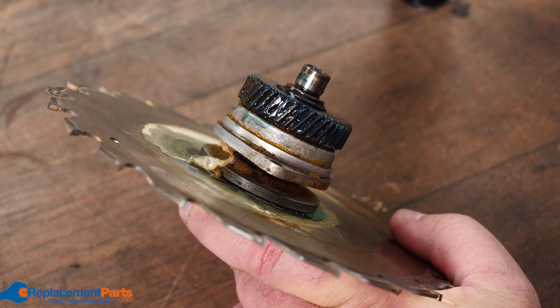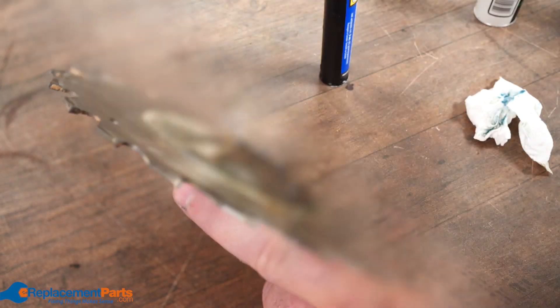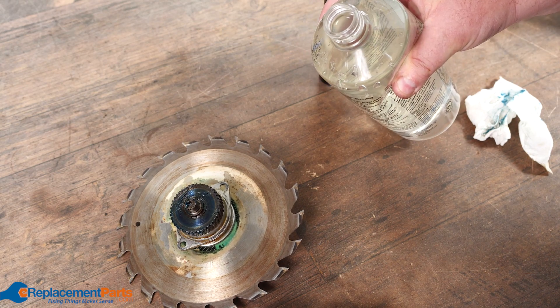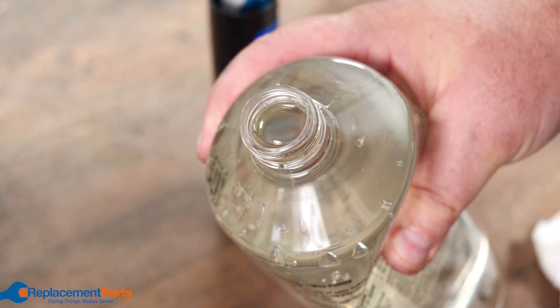You also have to be careful when dealing with grease on wires, because some greases will actually eat the rubber coating on the wire. There are some greases, like this one, that are specifically meant for wires. You coat wires when you're pulling them through particular tubes, and that grease stays on the wire permanently, adding a little bit of extra protection.